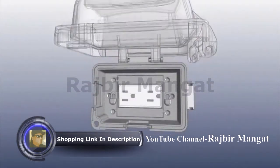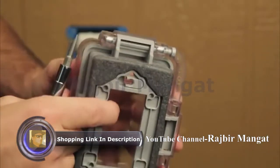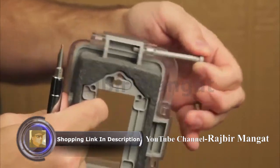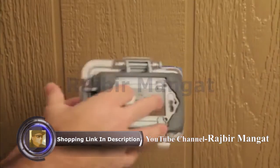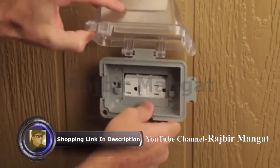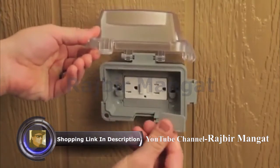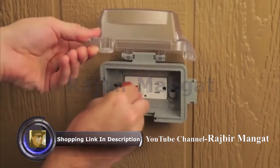The pin may be tight, so if necessary, push the tip of the pin with a screwdriver to release it. Then simply pull it out from the other side, and insert the pin into the other hinge until it snaps in place. Now ready to mount horizontally in the same manner as the vertical install. Remove the bottom cord port insert and direct the cords through the port to close the cover, ensuring the latches snap shut.